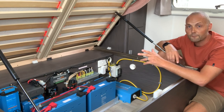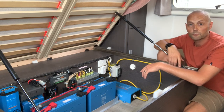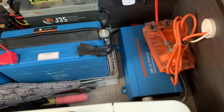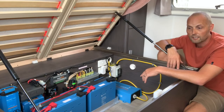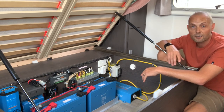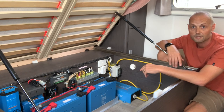What I did was buy a 15-amp lead from Bunnings, which I plugged straight into my inverter, threaded it through the caravan — the same as the yellow one you can see now — and brought it out behind the fridge, plugging it straight in. I had an RCD (residual current device) from Bunnings as well for some safety. However, an RCD apparently isn't good enough for that particular setup — it was quite dangerous because my caravan potentially wasn't earthed correctly, and any voltage drop through devices in the plugs could potentially harm myself or my family.